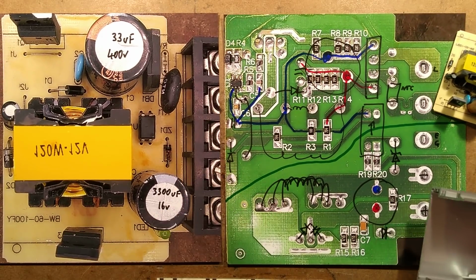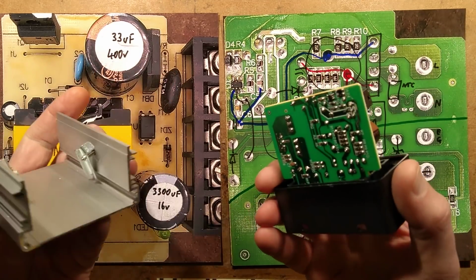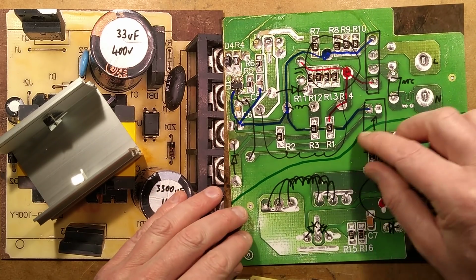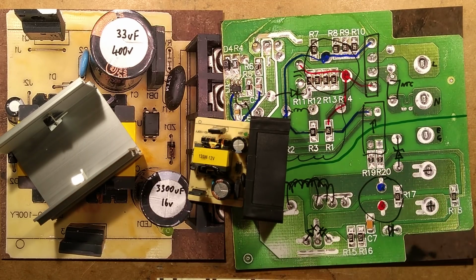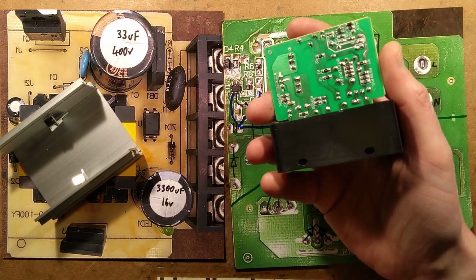It's always quite interesting looking at other people's electrical work. And that's more or less it. It's neat enough, it's a functional little design. The separation isn't fantastic. There's no sort of routing out for anti-tracking. Certainly, I wouldn't rate this for a wet environment, even though that's what they rate it for. And it is just going to be a nice haven for insects.